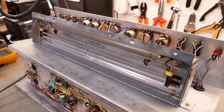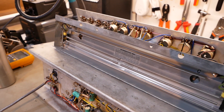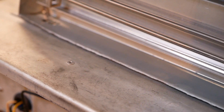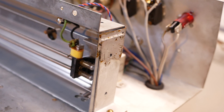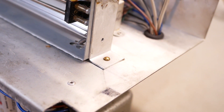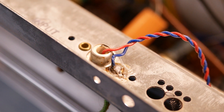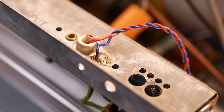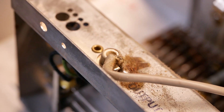You've got Ducon caps everywhere - made in Australia - and even Australian-made resistors. Here's the output section and the main power supply. Here's the reverb unit - it looks pretty similar to an Accutronics or Belton, just the dimensions, drilling, plating and metal thickness are different. They've tin-snipped off a wing and mounted it against the chassis, and curiously instead of just screwing it they've brazed the bracket to the end and then used a self-tapper brass screw. Instead of using an RCA connector they just ran the wire straight through the hole and soldered it internally - and to the chassis. It looks like some kind of acid flux was used. You find all sorts of weird stuff like this on Australian amps.